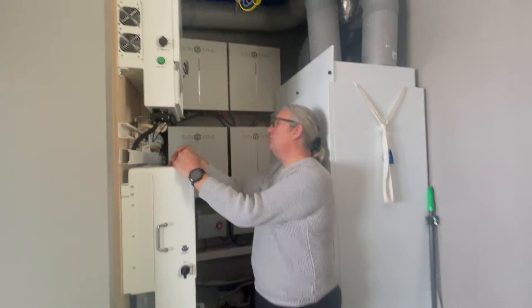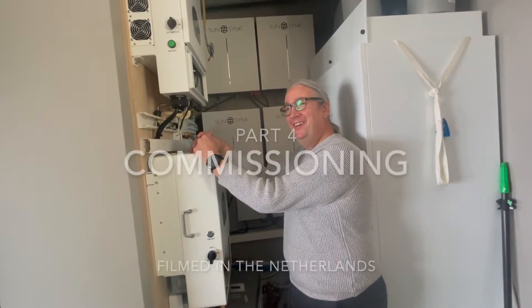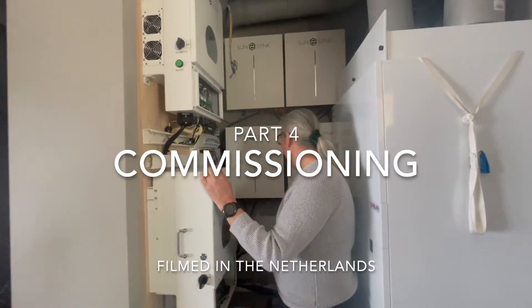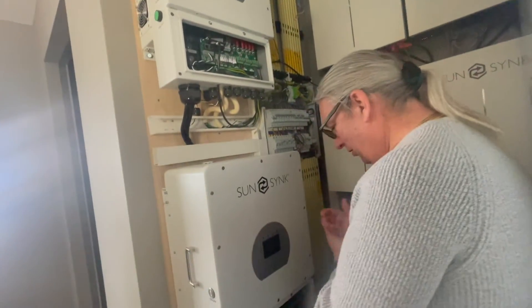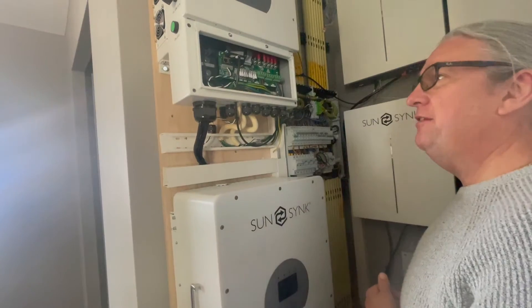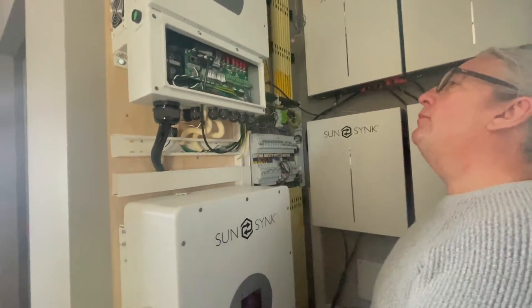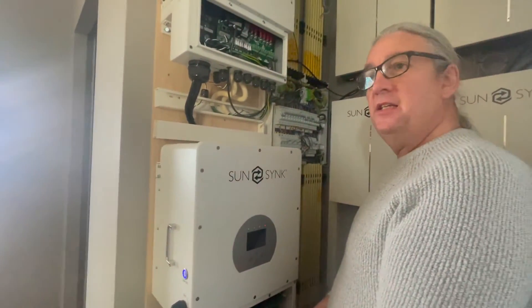All installed and working. We've got the CT coil down here on the feed in, and there's no AC — the AC is disconnected. What we should always do is put the inverters on batteries, on DC first. These are not parallel but very different, so we put the inverter up and let it power up, then we'll check all of the settings on the inverter.